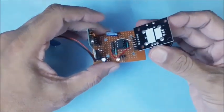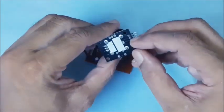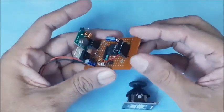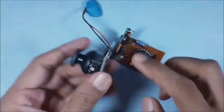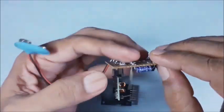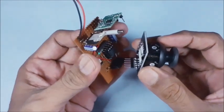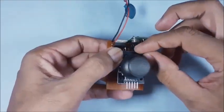So far the joystick is kept vertically on the main board. Keeping the joystick parallel to the main PCB is more comfortable while operating. For that, the 5-pin connections below the joystick are to be connected using a separate 5-pin berg strip, which is to be matched on the PCB also. Carefully solder the berg strip below the joystick. After matching the position of joystick on PCB, make necessary holes on the PCB to hold the joystick in position. For final assembly, one or two long screws are inserted from the bottom of the PCB. Use a sleeve to have some gap between the PCB and joystick, and to make the joystick board parallel to the PCB. Carefully assemble the joystick on the transmitter board and lock it using suitable nuts.